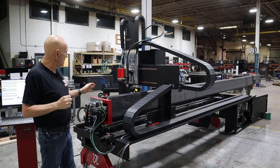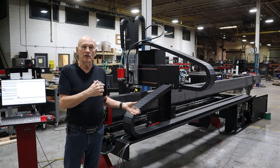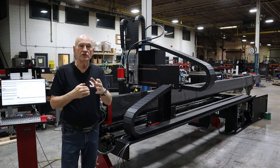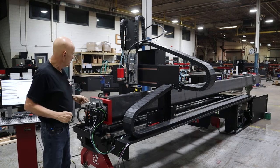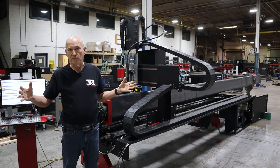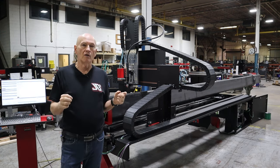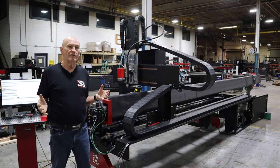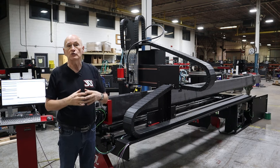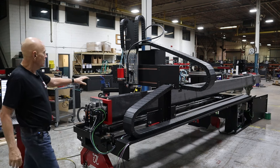The machine isn't limited to 12-inch material. For instance, we can cut 18-inch pipe — we just can't cut it 24 feet long; it's an inertia issue. The greater the inertia, the harder it is to spin accurately. We're limited to the inertia of a 12-inch Schedule 80 pipe at 24 feet. At JD Squared we shoot for 80% capacity to keep machines 24/7, 365-day reliable without pushing motors beyond a safe point.